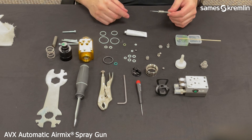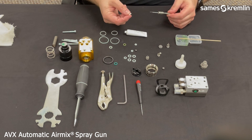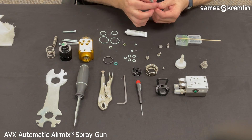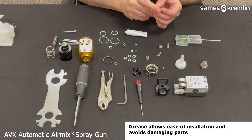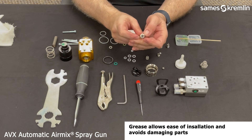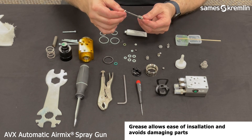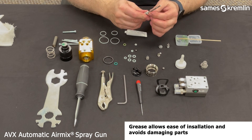To begin, we will insert the O-rings onto the needle cartridge. You will want to lubricate the area and the O-rings with the Teflon grease to allow ease getting them into the O-ring lands for both the top and bottom.